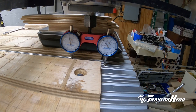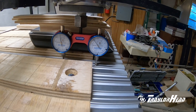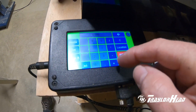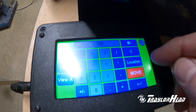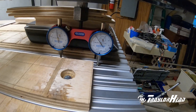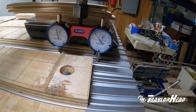What we're going to do is move the gantry down by a tenth of an inch using the pendant. By doing so we should get the same indication off our dial indicator, which will show that it moves without any deflection at all. So — one tenth inch, no deflection.